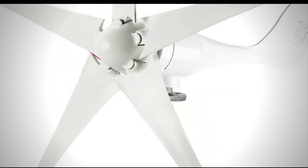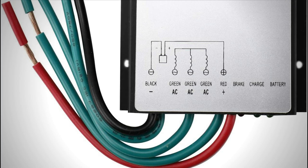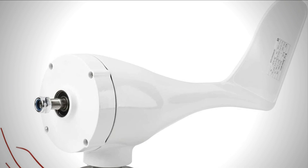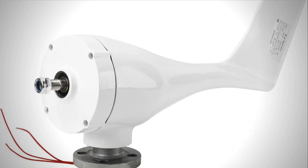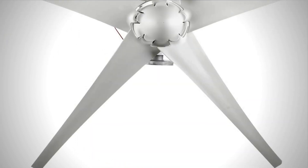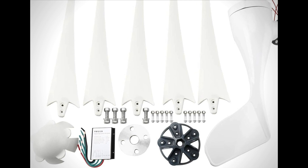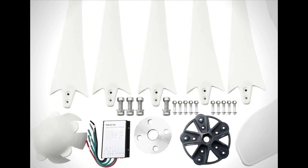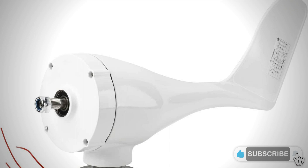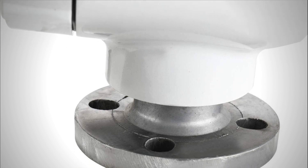Next is the Yay Marine wind turbine, also rated at 400 watts with a maximum wattage of 430 watts. It is 12 volts DC and comes with five blades. The main engine's net weight is 13.6 pounds or 6.2 kilograms. It has a larger windward area enabling it to generate electricity at lower wind speeds — starting wind speed is 2 meters per second and rated wind speed is 11.5 meters per second or 25 mph. This unit is substantial, has nice casting, white enamel gloss paint, well-milled and finished parts, and nylon blades. The charge controllers appear fully weather resistant. Some reviews note the power output is not as per specifications, but for this price it deserves third place on our list.